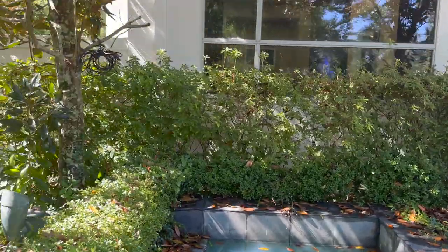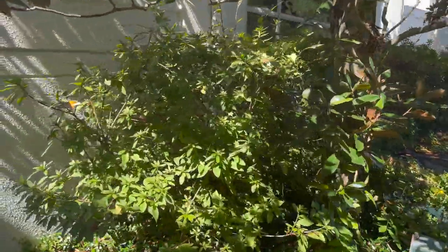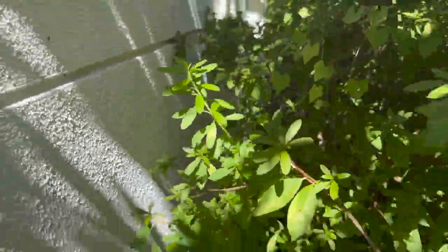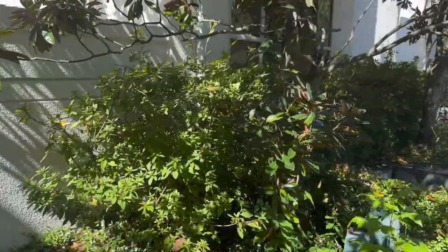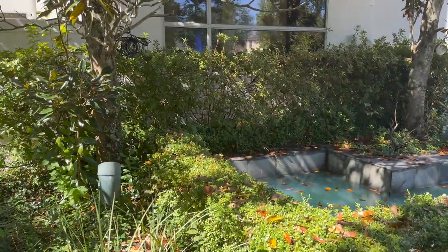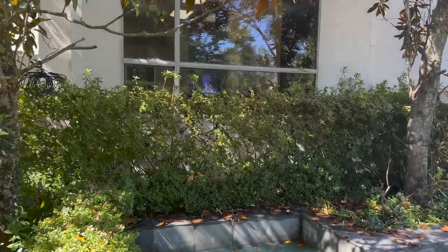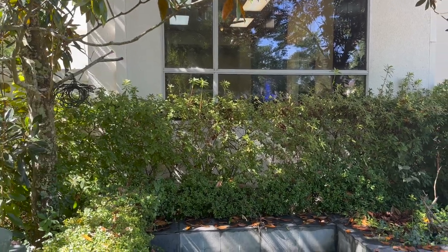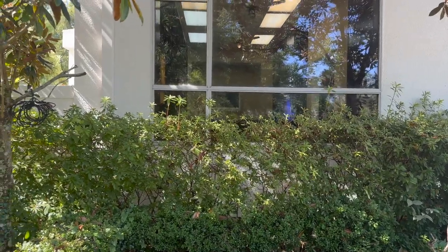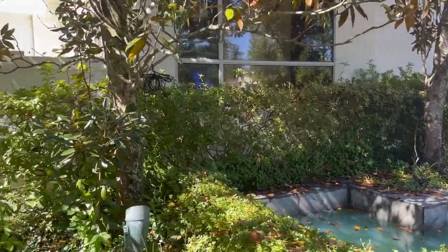This is typical on almost every inspection report — heavy foliage around the structure. They also have a lot of sprinkler heads spraying directly on the window and the wall, and that is actually one of the number one causes of stucco water intrusion. Sprinklers spraying onto the wall and damaging it every day over a long period of time is what rots out a lot of stucco and causes people to have to repair it.